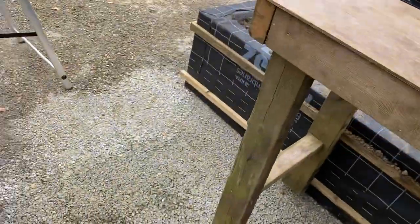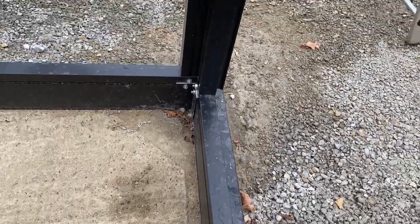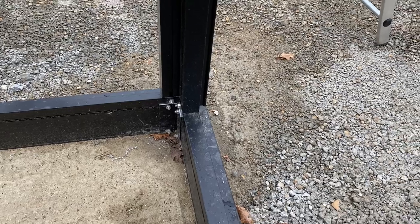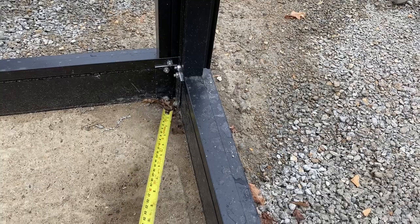The first thing I'm going to point out is that at the bottom, in the corner, they suggest that you leave the corner of the concrete out so that this particular member could go down, and then it's potted afterwards, as you can see I've done.